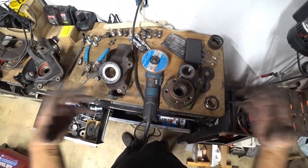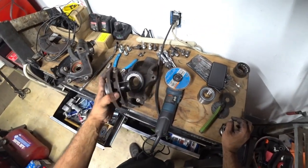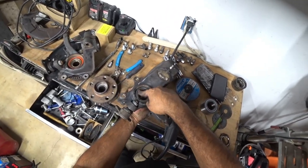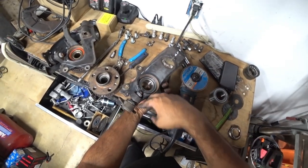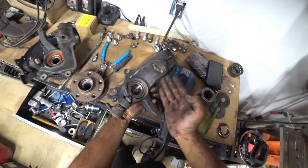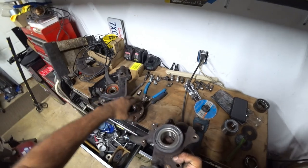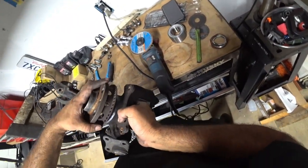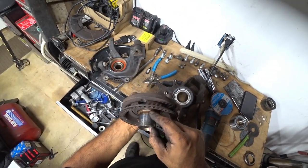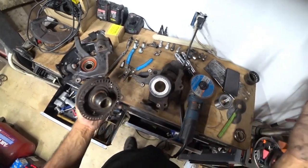Next step is to install your hub here. The trick to this is when you start pushing it down, you need something to press backwards with it — you need something underneath here while this is on its way down. Because if you don't, what's going to happen is that this is going to pop out and you're going to damage pretty much all the work you just did for nothing. So make sure there's something on this side while you're pushing down this way. This goes in nicely and will stop on its own — you'll see there's a gap right here. This machined surface will hit here and that's it, you're done, you press it all the way down.